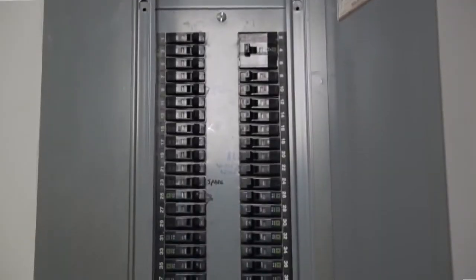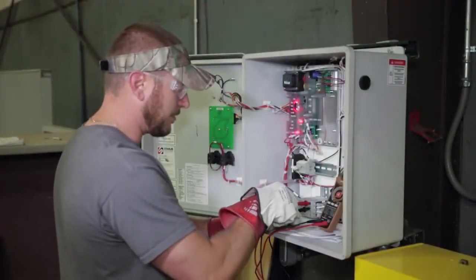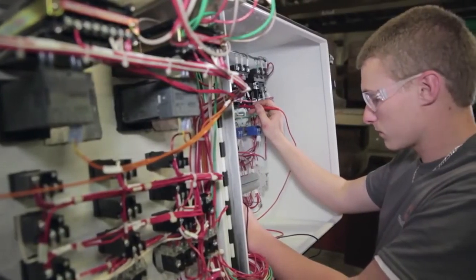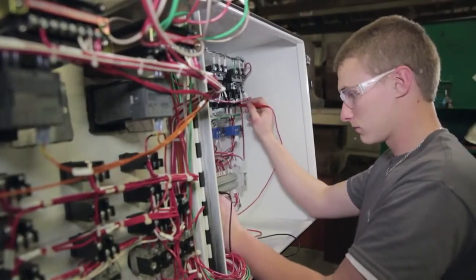Resistance is used for checking different parts of the circuit for opens and shorts. If a breaker continues to trip or you have a dead circuit, the resistance function can help isolate where the short or break is located. Continuity determines if there is an electrical path between two connection points — the meter simply gives you a beeping noise so you know there is continuity in a wire, cable, or the device being tested.